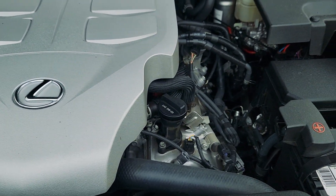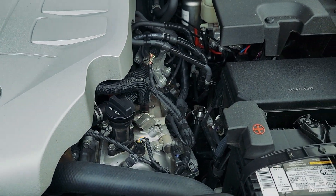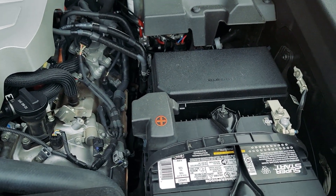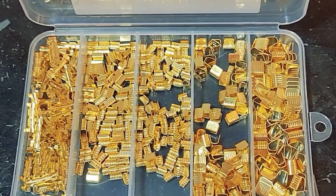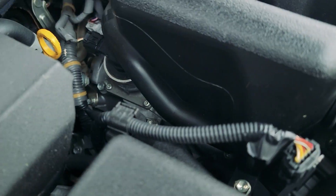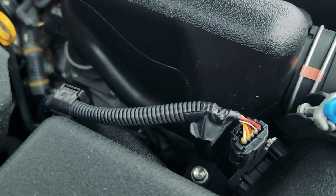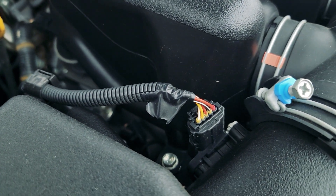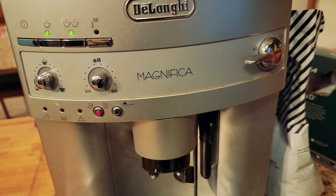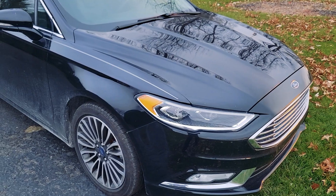My takeaway: the items around me that are quality and known to perform well are using crimped terminations. Most commonly used are open barrel type crimped connections. These will be found in many of the pin and socket type plug connections in automotive applications, as well as most manufactured electrical products. You've seen them before — now you know how they perform.